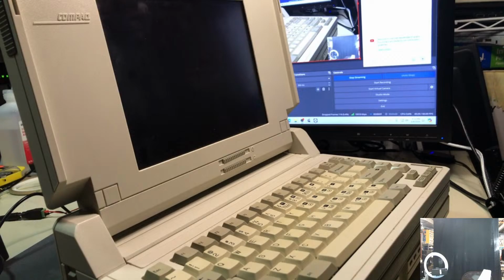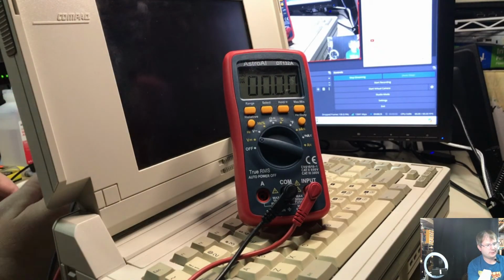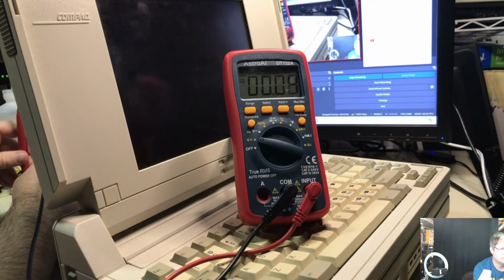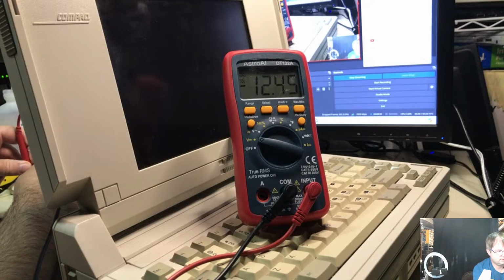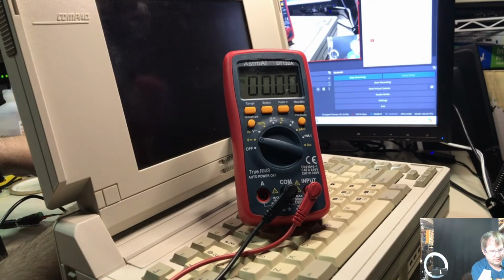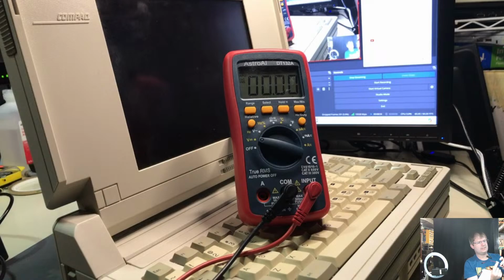The one thing we know is that this thing powered on. Yeah, that's DC voltage. There we go, DC voltage on. And we have 12 volts. I wonder if we got it at the very end here. If we do, then oh boy, we're going to have... Oh, maybe not. Maybe we don't have voltage on this end cap here. And that in itself could be our problem.